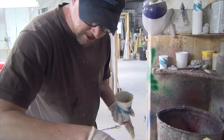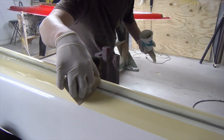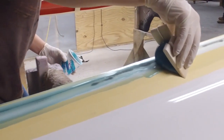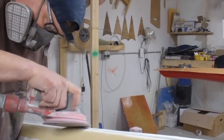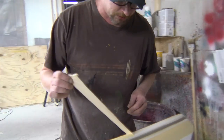This is what makes the seam. When we first put the glass down you can see the white. With the squeegee, it actually embeds the resin into the glass and gives it a smoother finish. So when I come by to sand it before the last pass, it's glass smooth.